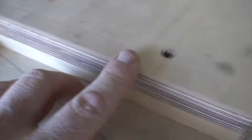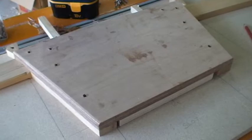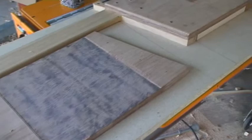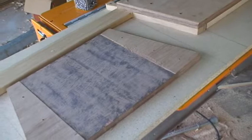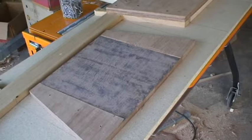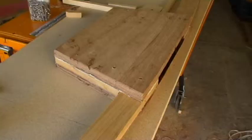So this is all ready to put together. What we'll do is glue these parts together, then pop it off the jig and put our other side on. As we do this, we'll put unthickened epoxy just over the middle of the center case on both pieces. That will get the first coat on, because we need to keep the water away from that part of the wood — it's also a part that's going to take a bit of abrasion, so we'll put another coat on as well once we've got it assembled.